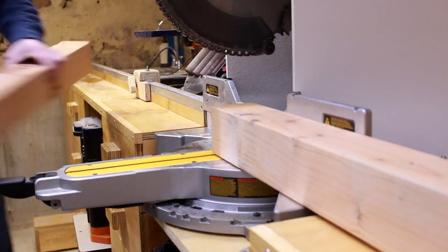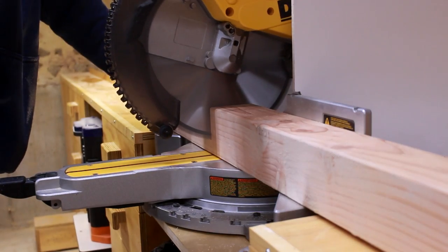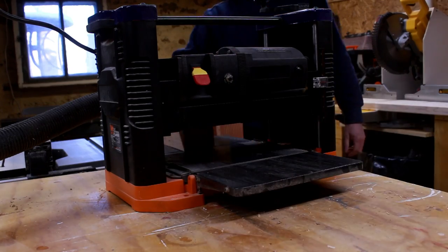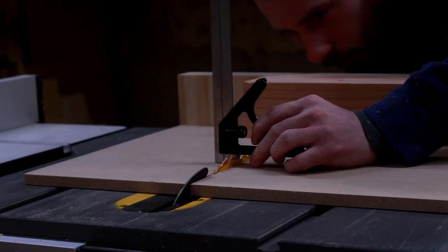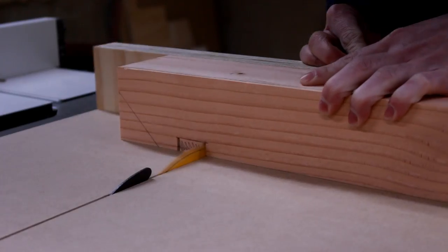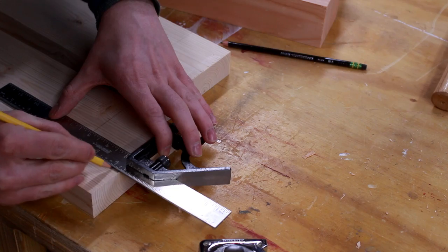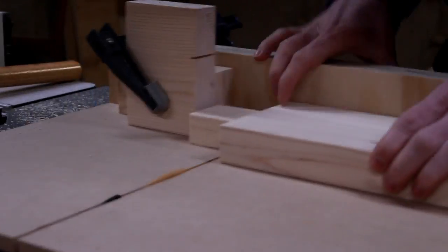I decided to make a sawhorse to hold up the other side of the table — this part is completely optional and you could use regular table legs instead. I'm using dimensional lumber from my local home center, cut to rough length and then run through the jointer and planer. Once I had everything down to the right thickness I cut them to exact dimensions using the table saw and miter saw. For the top part of the sawhorse I cut out two notches which the legs will fit into — since I don't have a dado set I had to make a lot of little passes through the table saw. I then cut a 45 degree angle on each side of the crossbeam for a cleaner edge. Next was cutting the tenon on the bottom of the legs to fit into the leg base, again using many little passes on the table saw for the length and depth.